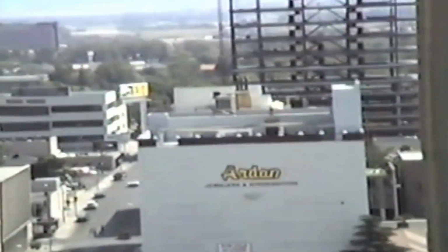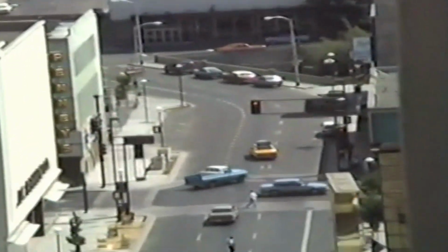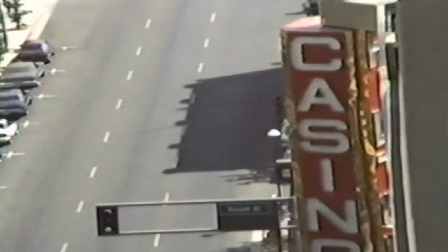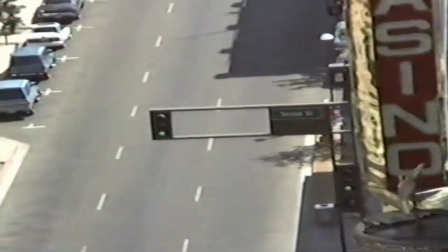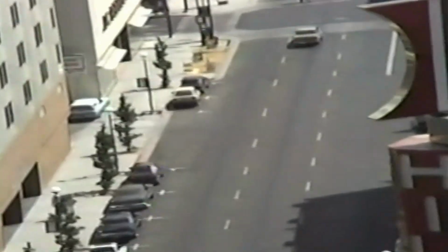The Magnavox ZV457MG9A: replaced all the capacitors on the DVD recorder board, made a DVD test, playing back right now, absolutely perfect. Repaired the power supply for the Capstan motor, the 5 volts was missing. Troubleshot and replaced that shorted capacitor and the open transistor. That's the end of the video.